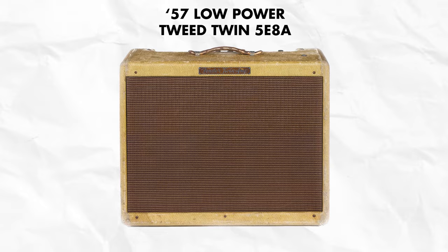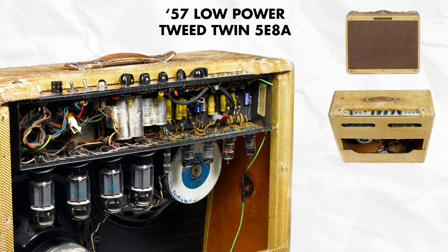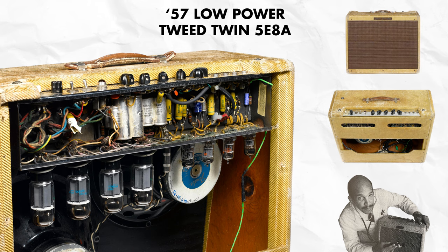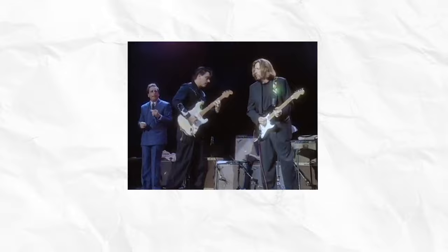Clapton found this 5E8A tweed circuit sometime in the mid-80s at Pete's Guitar in Minneapolis. According to a ToneQuest Report article from August of 2000, the amp was modded by Cesar Diaz in '86, who replaced the power transformer with an export transformer so that it could be used in both the US and the UK. Diaz also replaced the dual rectifier tubes with a solid-state silicon rectifier and installed two more 6L6 power tubes in the place of the removed rectifier tubes. Lee Dix, Clapton's guitar tech at the time, stated they typically ran the amp with two of the output tubes pulled to cut the volume. The amp first made its live debut in February of '91 during the blues night of Clapton's legendary 24 Nights run at Royal Albert Hall.